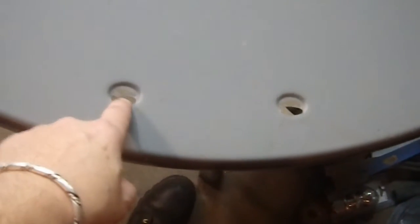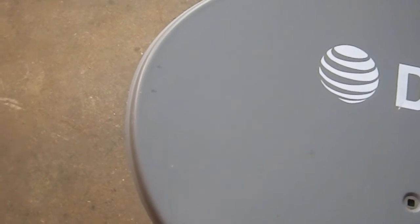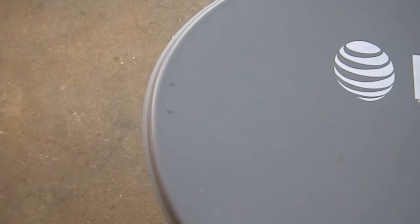The dish was only held in place by two fasteners, which I've saved. The rest of the equipment was hooked so the weight rested on the hooks and those two held it in place. I've laid out marks on the dish and I need to drill two quarter-inch holes through it. The problem is I'm not 100% sure how to hold this thing — it's a large, awkward, curved object. I'm going to get my sawhorses out and clamp it from two ends so the curve goes in the middle between them.